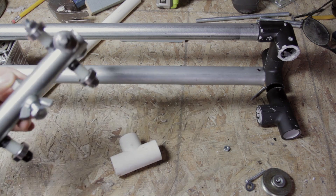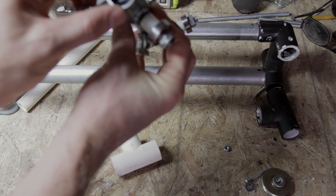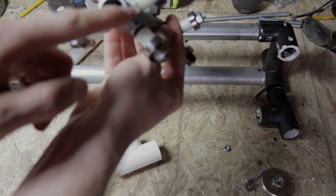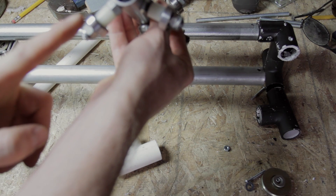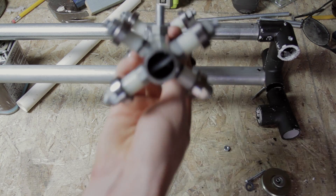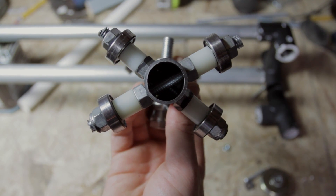I used basically the juice link slider design, and I took a piece of conduit — just electrical conduit. I drilled through and divided it into six pieces: you've got your halves, then your quarters, but I want six. So you need to drill a hole straight through one of those six, and then take another hole and drill it through the other one right next to it. So you end up with something that looks like this — a nice anchor point for your bearings.